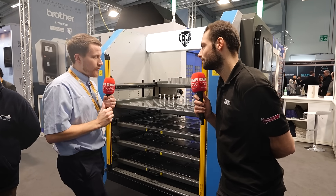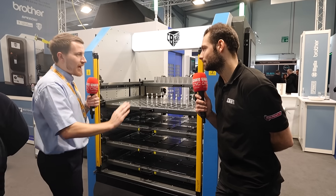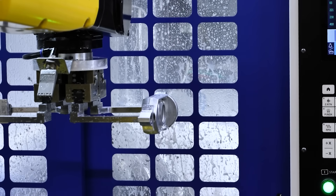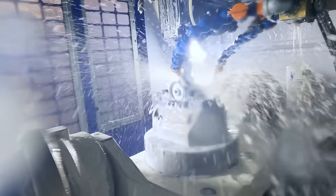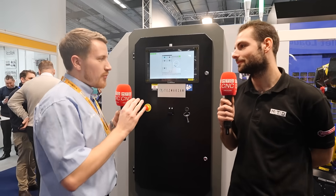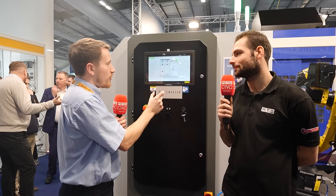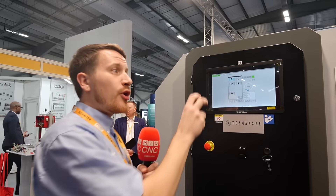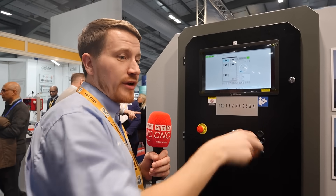The tray system is based off the loading bay. Once you break the signal, you're in the loading area — you load the tray up and push it into the robot area. When it's in the robot area, you nominate that the robot's running, and it will work out which tray it wants — working its way down from tray to tray. Once it's finished the tray, you push it back into this area. For programming a changeover for a brand new grid plate — it's fairly simplistic. It's an additional robot and the software does it for you. You've got a load sequence: load a single machine, load two machines, or configure a wash-off system and then place. They're just a simplified app — you go point by point, task by task.